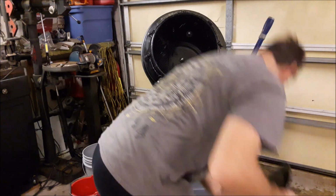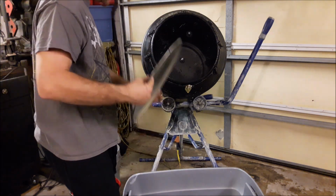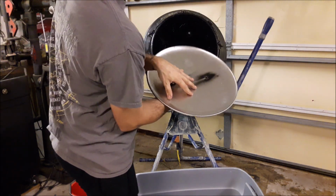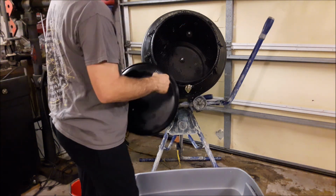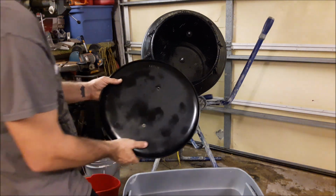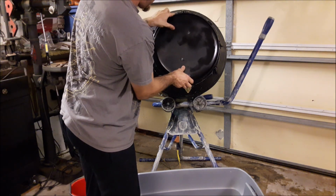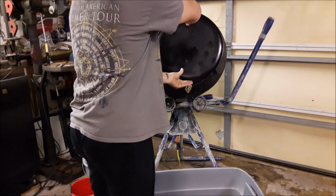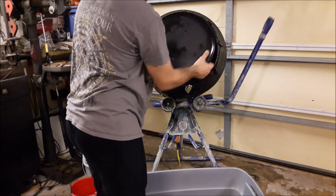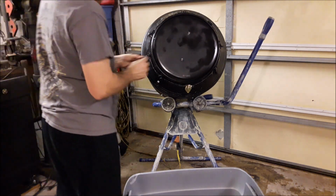For the wash cycle, I've noticed that if you just let it run, the stainless steel pins will just fly out. They'll be all over the place. It's a huge pain in the ass. That's where the 16-inch pizza pan comes in. I spray painted it. I ran out of paint, so I wasn't able to do this side. And I did not measure where the holes went, so I carved latch into the top of it, which was real easy because I painted it, so I just scraped the paint away. Latch tells me that this hole goes close to the latch. Then I don't have to fumble around with it, because if I do it the other way, I have a gap over here. It's on the screws. So, put that on, pop those out. I grab my little wing nuts.